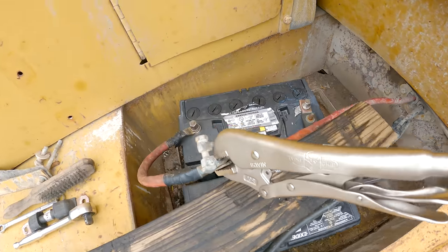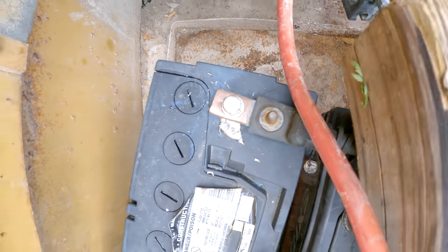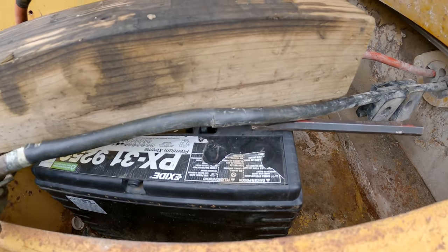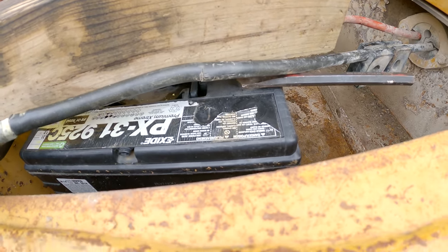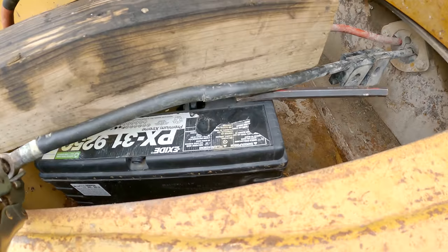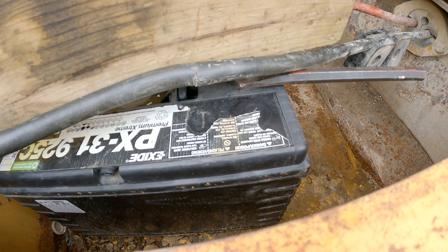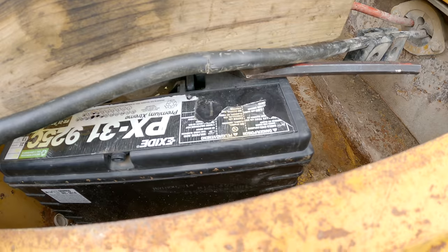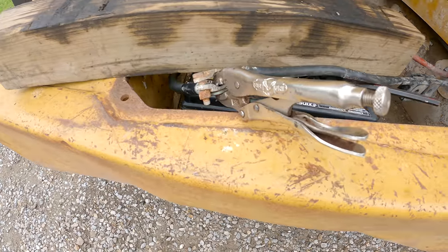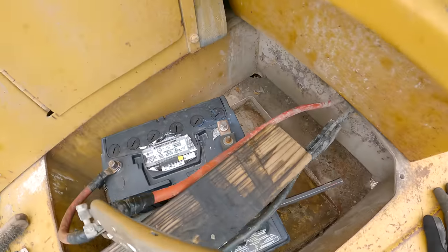Only did a little bit of unintentional welding when I was hooking this all up. That wasn't bad, but unfortunately when the unintentional welding began, it also completely destroyed both terminals on this end of the batteries. So what we've got here is a chisel holding the battery cable down to the battery terminal in between the battery nut and the cable end itself. And then of course we're just using the standard vice grips on the negative end and the positive end here. That should be just fine.